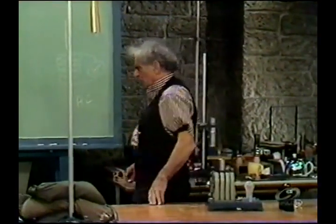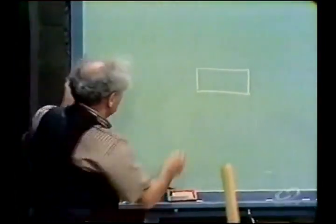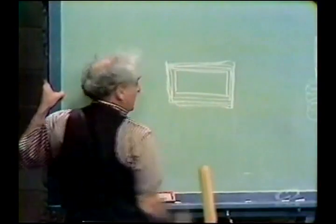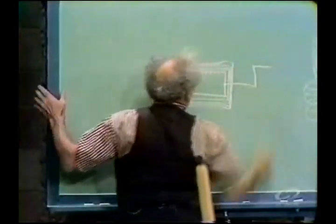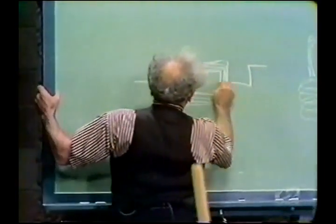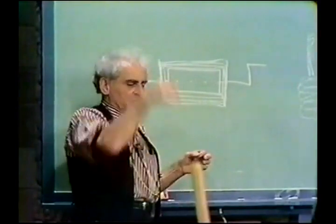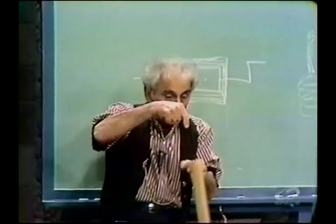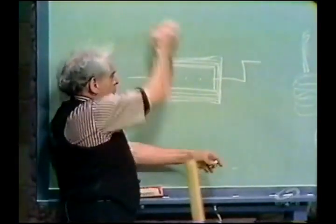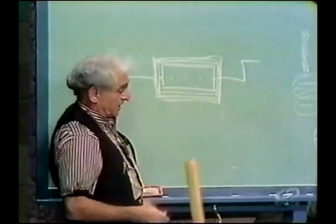We make it easier as follows. Let me wind on a rectangular frame a coil of wire. Let me equip the frame with a handle like an old-fashioned grindstone so I can turn the coil on this horizontal axis. Now remember, we had the magnet moving into the coil — I could just as well have had the coil move onto the magnet. So I am going to put some horseshoe magnets around this coil. One side of the horseshoe magnet is on the other side of this board, and the front side is on the front side of the board.